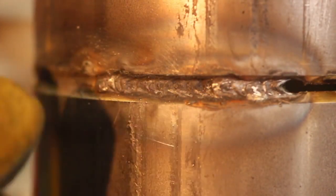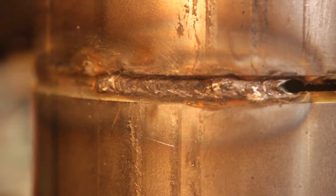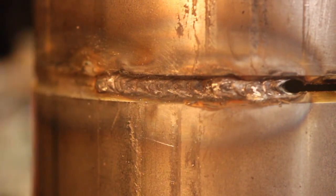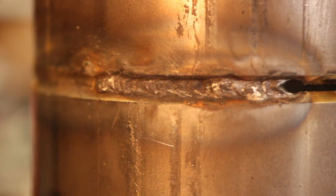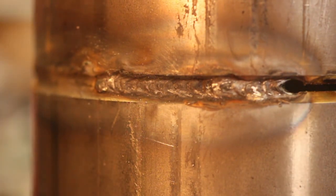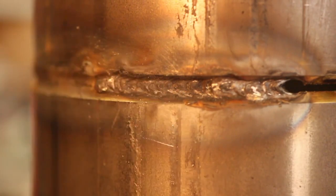So that is what it should look like when you penetrate fully through and have a flush convex root. Obviously, where I tied back in right here, you see this kind of bulbous little root part. Essentially, the goal is as you become a better welder, you only want to use your grinder when you absolutely need to — in mistakes, poor fit-up, damaged material, or repair work. In this case scenario, I want to have a nice penetrated root that lays flush.